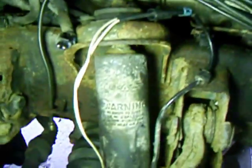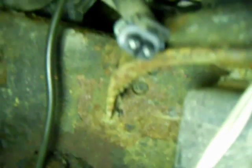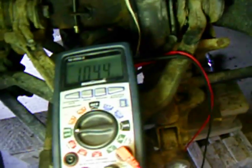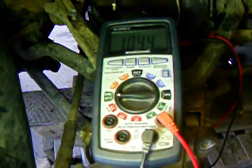Nevertheless, I disconnected it right up here over the shock mount. There's the female end of the connector, which goes to the ABS module, and the male end on the sensor side. I had to adapt some little clips to get onto there, and you can see the resistance reads 1044 ohms, 1045 ohms — fluctuating a little bit, but not much. I would assume that's normal for this sensor. When I check the other side of the vehicle, I'll check its resistance as well and post it in my comments for this video.